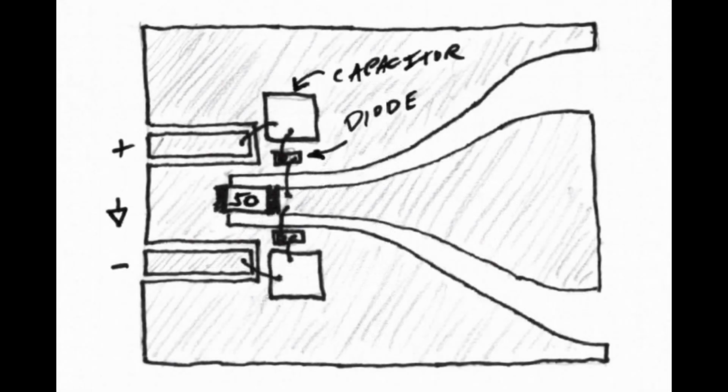Here is a drawing I made before I actually got a sensor in my hand, but I believe the sensors come in different flavors and stuff. And this is what was in my memory from 30 years ago, was that the RF comes in from the right, and there is a transition section of RF transmission line that takes you from a certain radius and frequency and stuff, and it snakes it down to a small size and keeps it all perfectly 50 ohms all the way through.